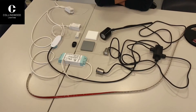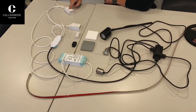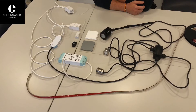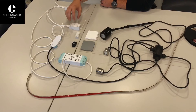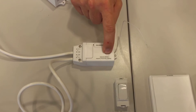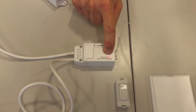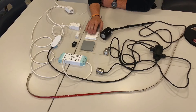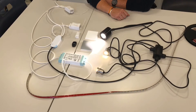We've powered the receivers — these two here. We've also got a series of switches in front of us that work on kinetic energy but aren't yet paired to those receivers. To pair, you ensure you've got power to the unit, press and hold the pairing button for three seconds, and you'll see the red light start to flash. Then you just operate your switch, which then operates the light.